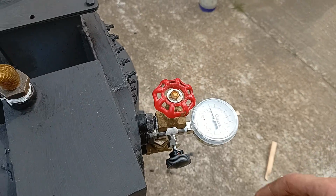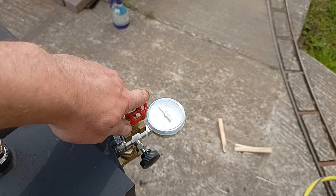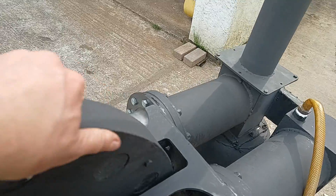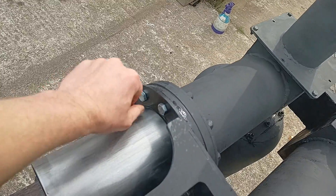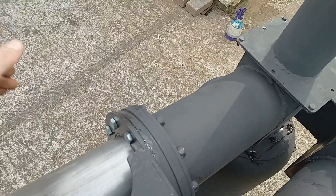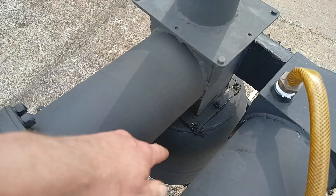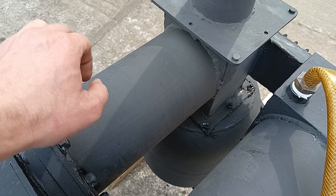I can't get the pressure for the moment - I'll try and run it to give some kind of pressure reading. I'll open the valve to vent the engine - it turns over fairly freely. I'm a bit worried that the support rings made out of epoxy are actually gripping. I was hoping to just run it for a period to loosen everything up. Things are fairly warm here for that poor little leather seal underneath. I'm wondering whether I need to create a small water jacket here just to keep temperatures down for that leather seal - or even insulation to protect it from the radiant heat of the furnace below.